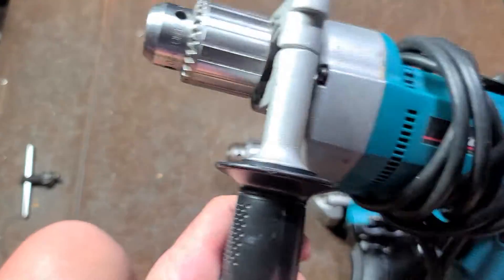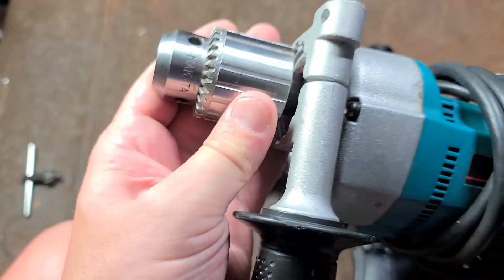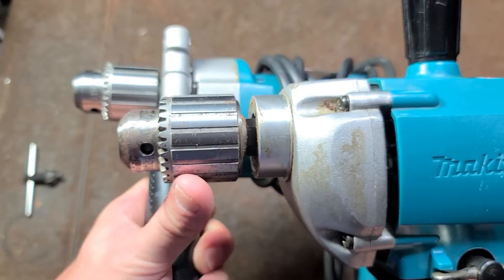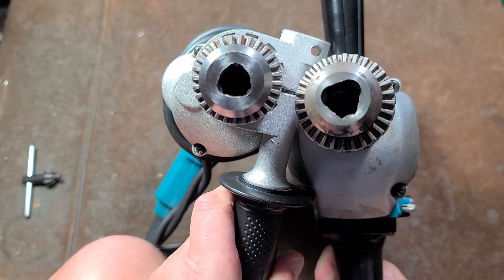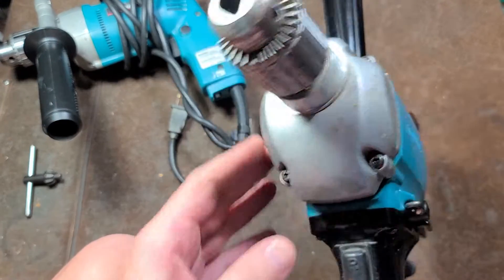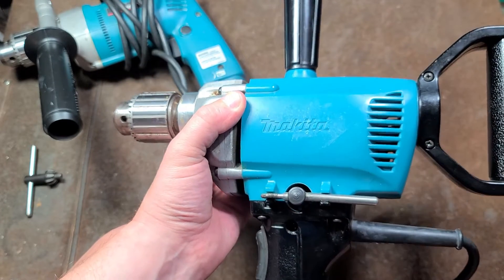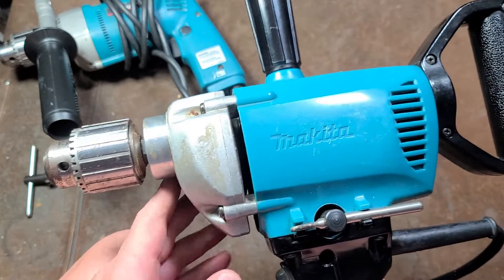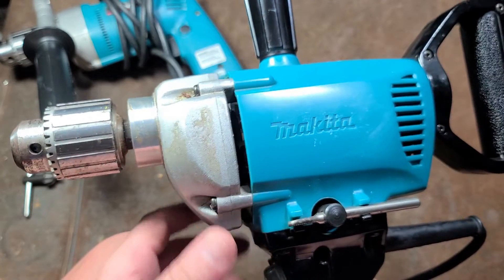The chuck on the pistol grip is actually a Makita manufactured or Makita-branded chuck. So it's interesting that on the bigger drill they went with a genuine Jacobs chuck. We can actually see the chucks next to each other — the chuck on the bigger drill is just a little heavier-duty. Bigger gearbox screws, larger reduction gears that can just take more heat and have more wear resistance because of their size. It also has a larger motor spindle, and this one still has a metal fan.